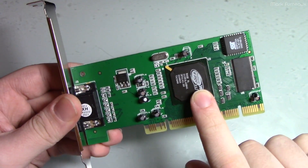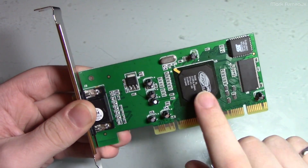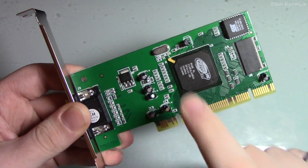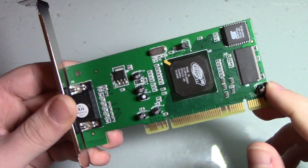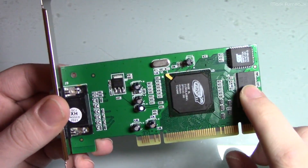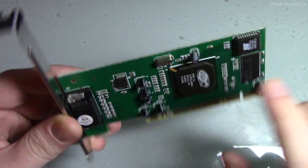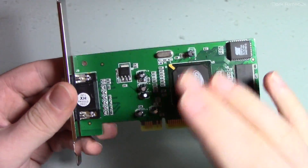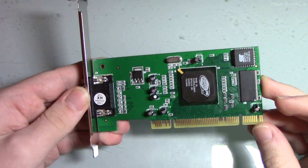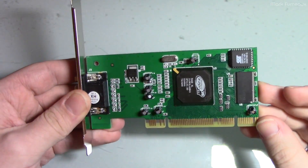This card is based on an ATI Rage XL, which was a low-end card from their Rage lineup that was produced up until around 2004. The date code on this particular chip is 2003, so this is a vintage chip, complete with dirt and scratch marks and everything. Same thing with the video memory and the ROM chip — I do believe these are salvaged and re-balled chips, which is fine as long as they work. It is interesting to see that there's clearly some place still manufacturing these, because there seems to be a lot of them out there.